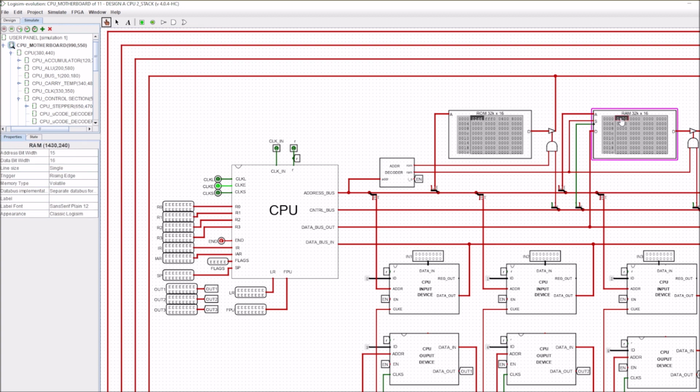So I'll just put the end command here, which now is 700. So all this is going to do just now is put the value FFF0 into the stack, and the stack's given by this here. Okay, so the 02 is going to be the data command. So that's the first 8, that's the top 8 bits of our 16-bit instruction. And then the D6 gives us the bottom 8 bits, and that tells us whereabouts we're going to move the value FFF0 to. And then the next instruction here is going to be the jump instruction, which tells it to jump to this address here, and the program really just ends at that point, so it doesn't really do anything.